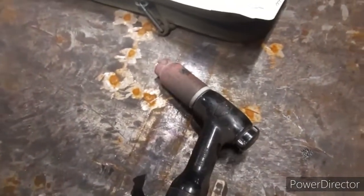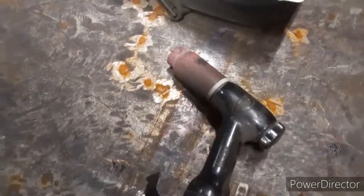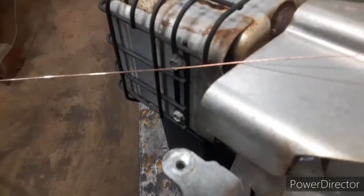Converted the torch over to the stubby setup. Went to 3/32 tungsten. It'll start off running 40 amps with 30 amps pre-heat. We're going to see what we can do. Got a .035 wire from a MIG — straighten that out. It's better to keep it straight. And I cleaned it up with some brake clean — off-brand stuff, but it works pretty good.